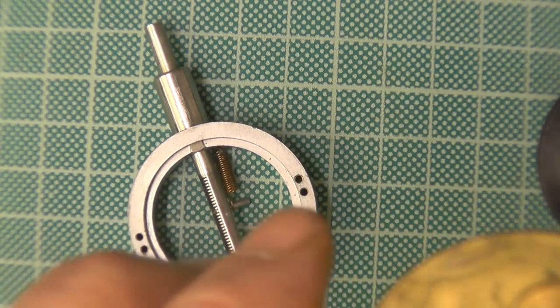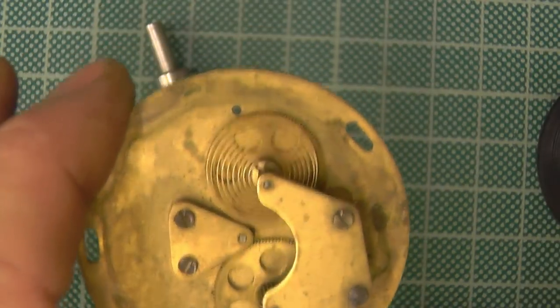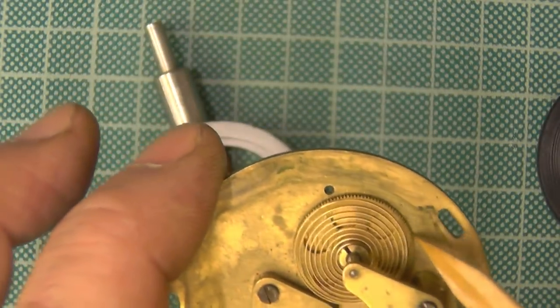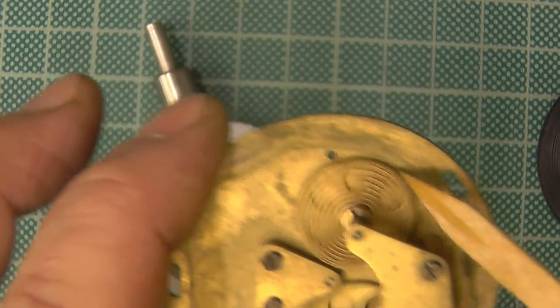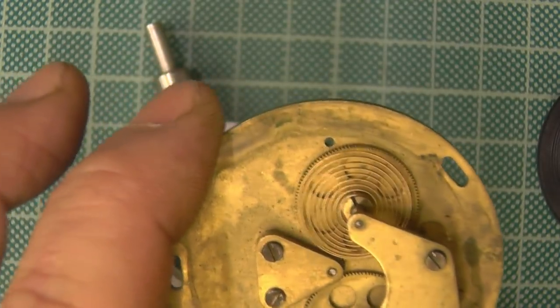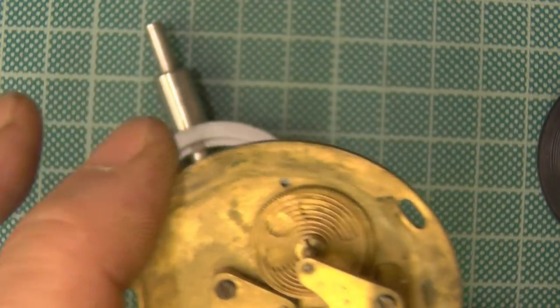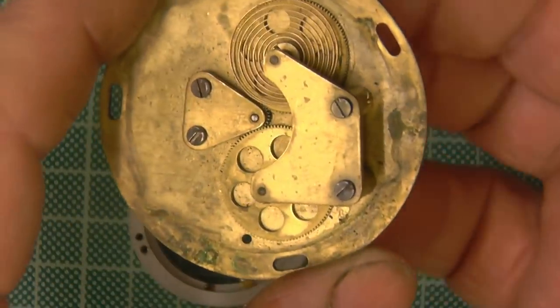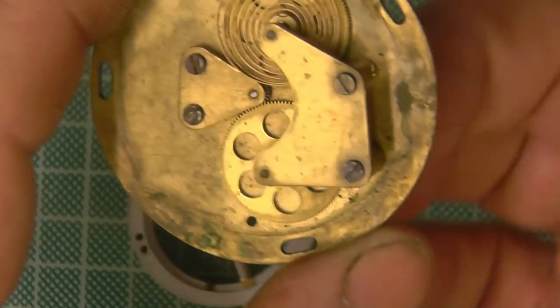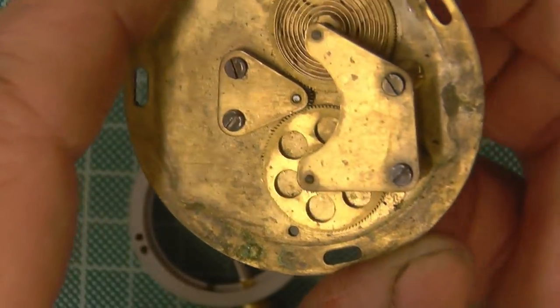The idea with the spring is, everybody takes a DTI to bits and they put it back together, and they don't put any tension in the spring. So what happens is, when it's moving, there's backlash in the movement, the handle stops anywhere you want it to, because there's no tension on that spring. Again, depending on make, model, feel, what I feel like, it's usually, in this case, I'm going the wrong way, I would say two turns.